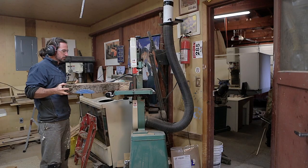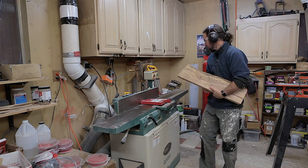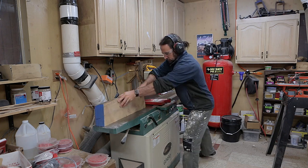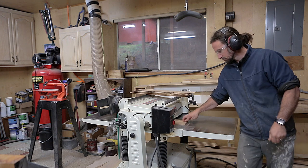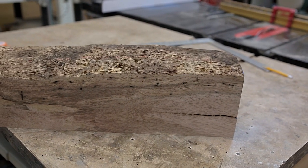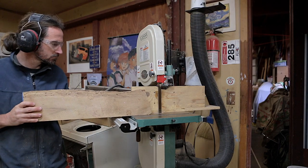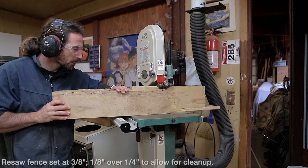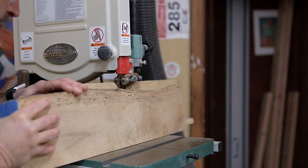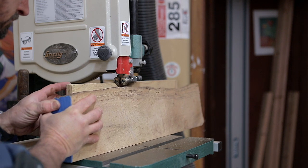This is some really basic one-on-one woodworking. I rough cut the piece with the bandsaw, take it over to the jointer and face one of the sides, then joint an edge and plane the other edge parallel with my planer. If the piece is wider than my jointer or planer, I will use my router slab jig to flatten the surface. Now I have a squared up piece of stock but it is really thick. I want the placemats to be about a quarter inch thick, so I'm going to re-saw them an eighth inch over thickness to allow some space for cleanup, mainly because my re-sawing setup is pretty janky and the boards were getting a lot of variation in width.